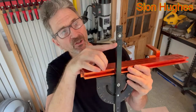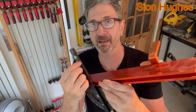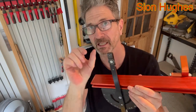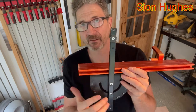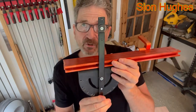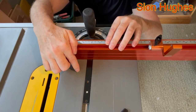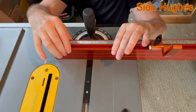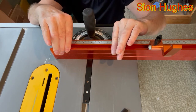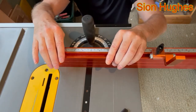On this mitre slot there are two little holes with grub screws, and on the back of them there are little ball bearings. The idea is that you can increase or reduce them to make them fit perfectly into the slot so you get less slop. For our purposes, when this slides into the table saw slot the ball bearings press against one side, and the other side is just flat steel. Worst case we could slacken those ball bearings off and orientate by forcing it in one direction to ensure an accurate measurement.